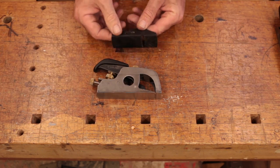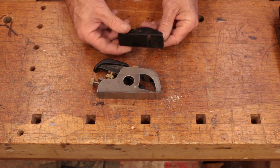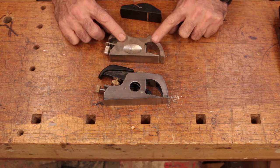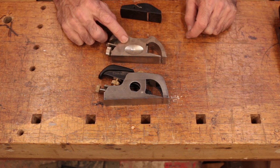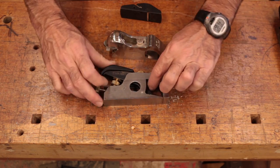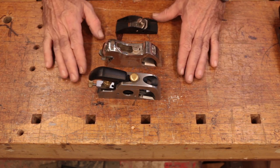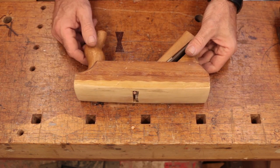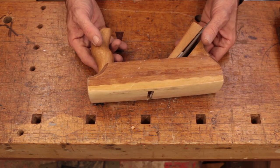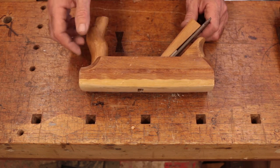The next thing you can consider is a little bullnose plane and a little thumb plane. These aren't super useful, but often you find yourself just chamfering edges quickly, and these are so cheap you might as well have one — you're talking about $10. The more expensive ones have better adjustability. The Stanley number 90 and the Veritas are the ones to look at — the Veritas was definitely worth spending the money on. That said, these planes are a complete luxury and you don't need them in your beginner kit. As you get farther into boatbuilding you might find yourself needing a backing-out plane, which you'll just have to make because you can't really buy them — it's just a standard wedge-type smoothing plane with the bottom and blade rounded over.